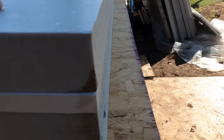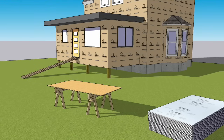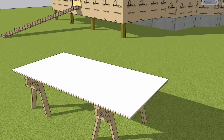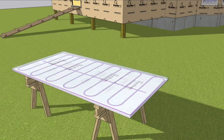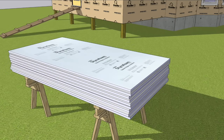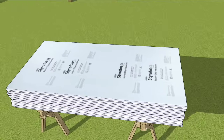The crew lays a full sheet of OSB across sawhorses to provide a flat and stable base. Next is a sheet of PVC, and on that they apply the adhesive. The styrofoam sets on top, and they make another panel atop the previous one. This allows the panels to be squished together and the adhesive to set up.